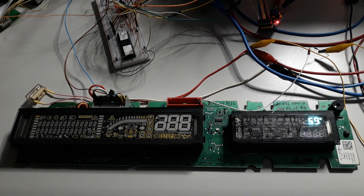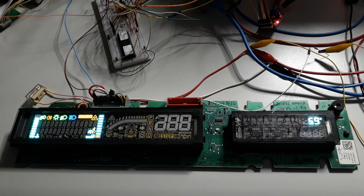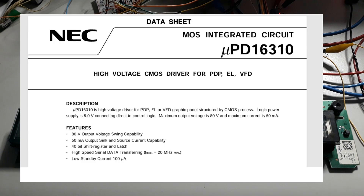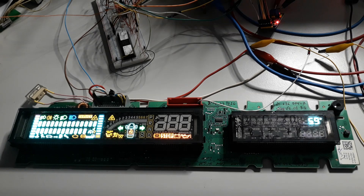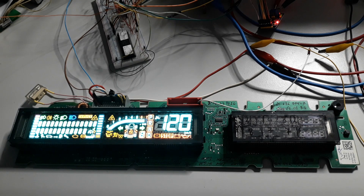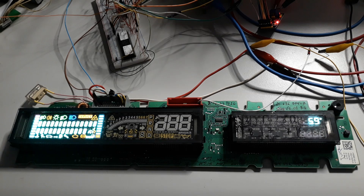The panel has a microcontroller responsible for controlling both VFDs. The smaller one belongs to the radio and has a VFD driver for positive voltage reference, the µPD16310. As noted, it is for positive voltage and reaches pins 21 and 44. This voltage is near 50 volts, which if you try to measure while it is working can cause damage to the driver if the multimeter pins touch incorrectly. Next to them we have both VSCS1 and VSCS2, which as a rule are connected to each other. VDD is the plus 5 volts to power the logic of the driver.